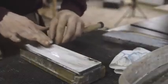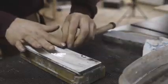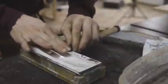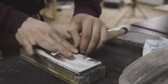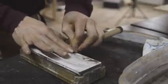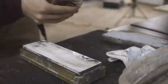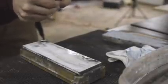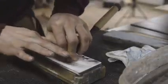Also, I don't know if you guys can tell, but I'm pinching the side of the chisel, and that's kind of like at 15 mil depth, so that way I don't go past it, but it's not really a huge deal. But the secret to this is to not stay at 15 mil depth the whole time, so don't use that as a guide. Kind of go from 10 mil to 15 mil, and that way you don't create a ridge on the bottom of the chisel. It's really for aesthetic reasons, but it gives you a much nicer transition from the more gray finish to the polished finish, and you guys will see that a little later on.